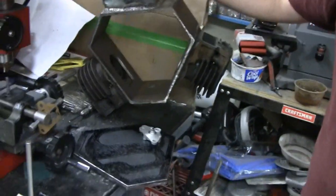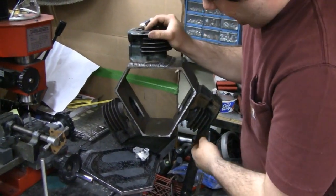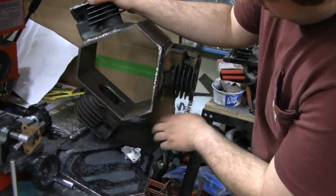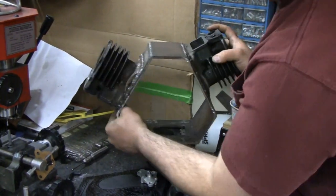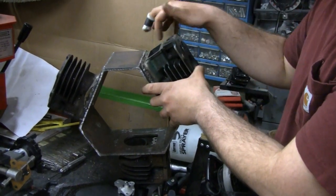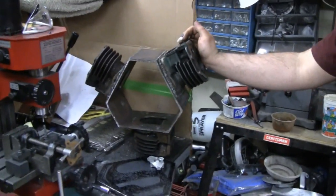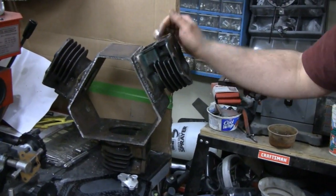So there'll be plenty of oil flinging around in this engine. As for the return, there were some concerns about that. I think I want to grind a little recess into this lower plate, and somewhere in the center or offset there'll be a drain back into the tank. And in this lower cylinder over here — this is obviously going to be the lowest point — in the valve cover we'll have another drain right here that'll drain back into the tank as well, just so we don't fill this valve chest up with oil. Over time it'll seep past the valve guides and might even lock up the cylinder if filled with oil. You gotta get some oil seepage, but that's common for a radial. It's gonna happen anytime you have a cylinder hanging upside down — it's gonna be smoke on startup for 10 seconds and then business as usual.